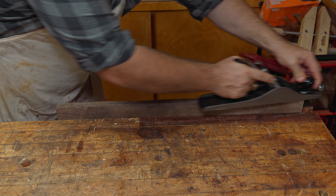When we first start this you want to run through a few times and you're actually listening to the plane. On a dirty board like this you can see where the parts get removed, but if you've already got a clean piece you can't really see that. The easiest way — and I'll demonstrate this in a minute — is that you can hear the kind of jumping of the blade as it engages and disengages as you go along the edge.